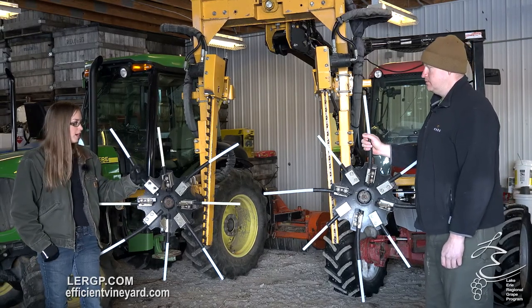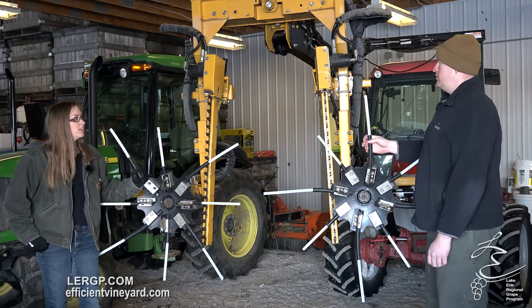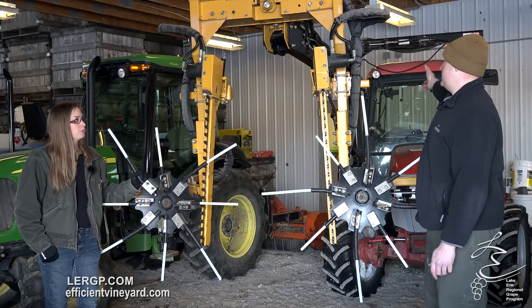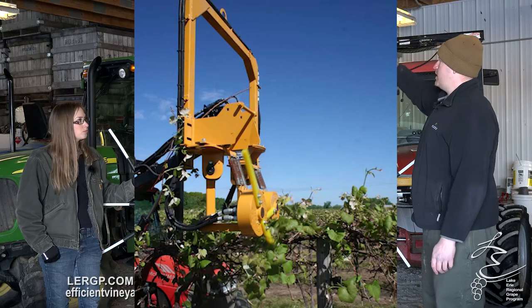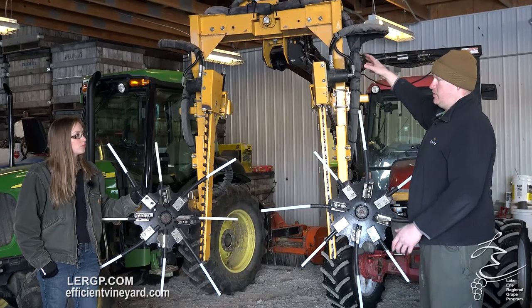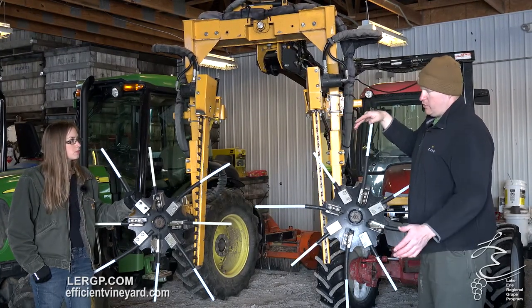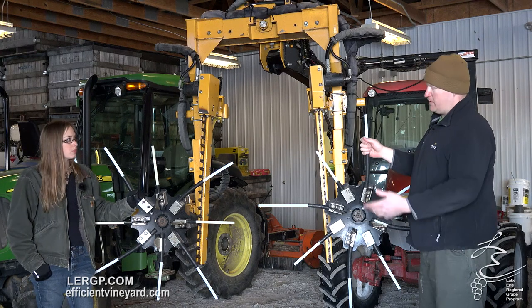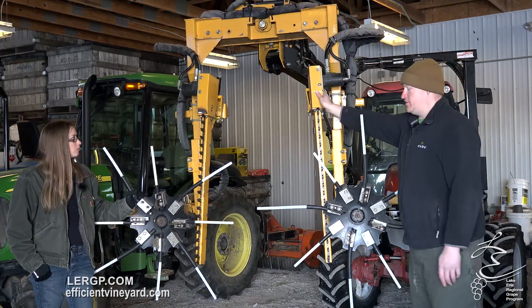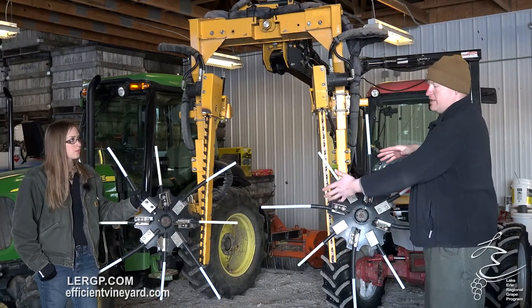So what are some other tools in the toolbox for managing crop? If it's your first year mechanical pruning and you left way too many buds out there, what else can you do? For growers that have the Oxbow tool arm, now the V-Mac tool arm, you could take this head off and put a shoot thinner head on. There are a couple of different attachments — sprawl pruners and stuff like that — that can go on and off this style head. For guys with the Joy pruner, which is a self-contained unit that is only a trimmer, you can remove your cutters, take the disc off, and put a flat plate on with the shoot thinner fingers, so you can modify it to shoot thin.